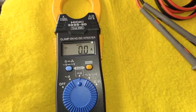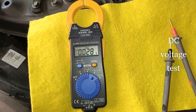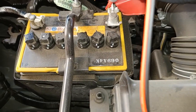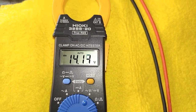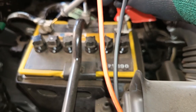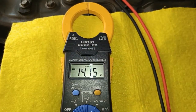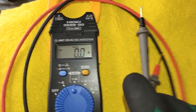Now to measure the DC voltage of the battery, I'll use the blue button to toggle to DC. Connect the test leads to the terminals of the car battery. I am getting a reading of 14.14 volts DC. You will notice that once I start the measurement and turn the function selector to the DC current function, the value of the reading returns to zero — I don't need to press the blue and yellow buttons again.